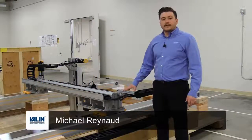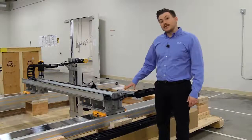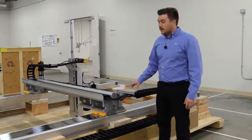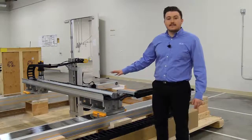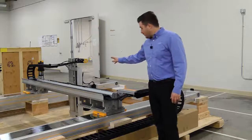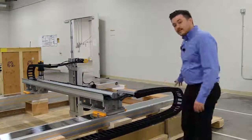A very important factor to keep in mind when sizing your gantry system is the cable management and cable lengths you'll need. If you think about it, we're going to need cables to span throughout every axis of motion. Starting with the theta, we have to go through the Z axis, through the Y, and then even through our X to get to our end.